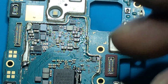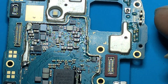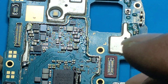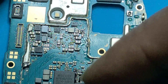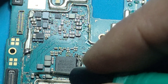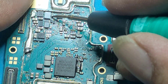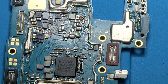VDD means the voltage equals 3.8 or 4 volts. And we can kill the shorted capacitor by the short killer. You can put the short killer here because it is VDD. In this machine, I found this capacitor is shorted by using the short killer.